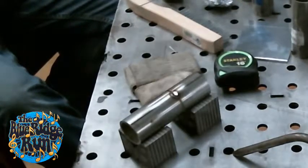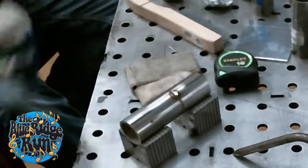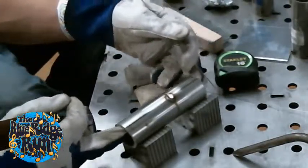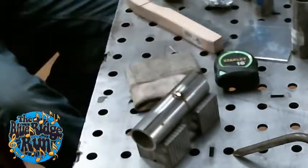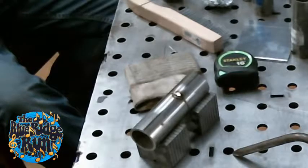So I might even pulse my foot. It just depends how it starts to weld. But this would be purged on the inside. Right. So being 1/8 wall, it's 125 thousandths, so 115 amps should do it, but I still like to go higher than that because I don't want to linger. Take the chance, yeah. You can always back down off the pedal.